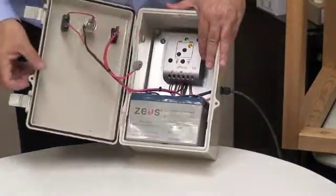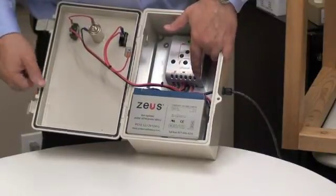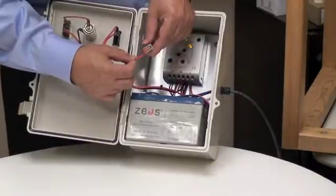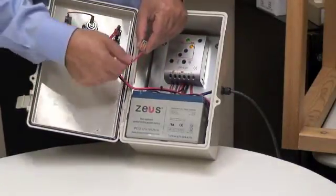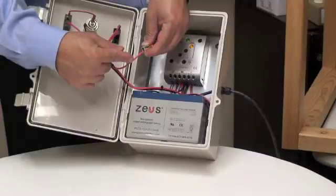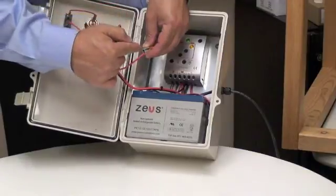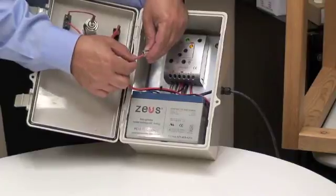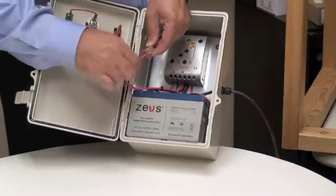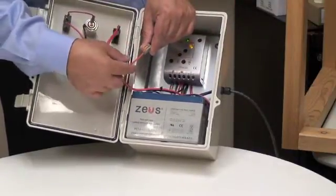When connecting your light load, you're going to put the negative side of the light load to the negative position on the terminal strip, and then connect the positive side of your load to the positive terminal. This is a very easy-to-use terminal block that Solaro uses on many of our products. You simply lift the connector up, strip the insulation back off the wire to expose bare metal, insert it into the hole, clip it down, push it, and lock it in place — making a permanent, good connection. The benefit of this connector is that it allows you to open it up again in the future if needed.